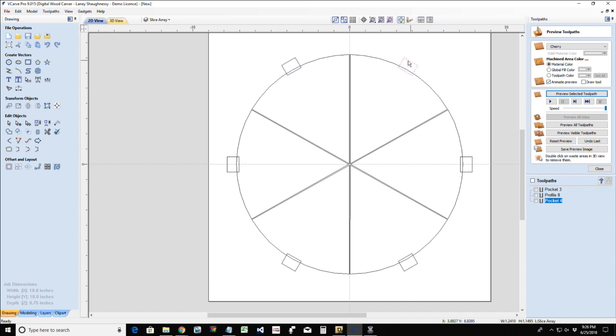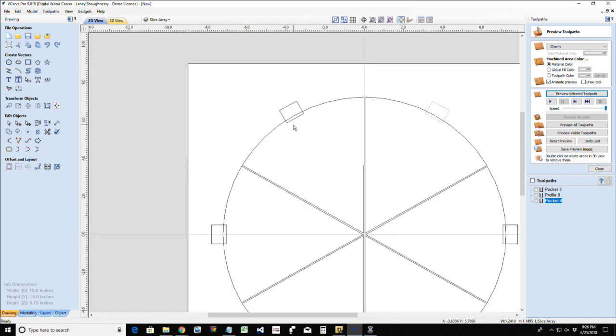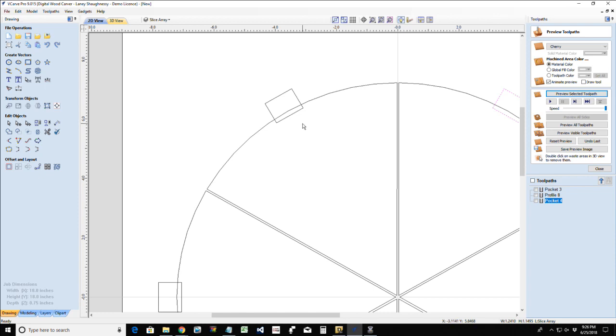These rectangles are here to help me with my layout of my handle. Now I'm going to do one, and like Debbie suggested, let's do one and just array it around, right? So we're going to create one handle, and we're going to array it around our center point to make all the other handles. So for this, I would like this handle to have, what's a good overall length? Let's see here. My hand is about 4 inches wide. So let's go about 4 inches.